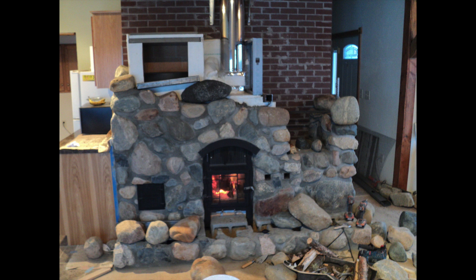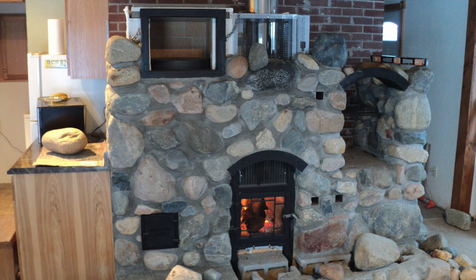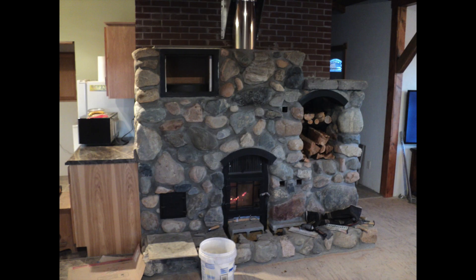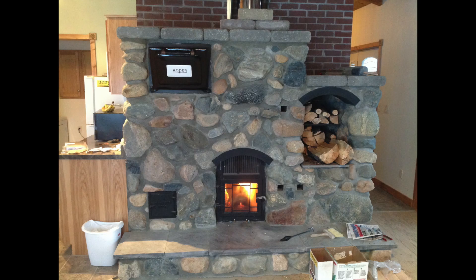The frame for the firebox door is made of steel square tubing. The bottom of the tubing is open to the passage in the hearth where the fresh air enters. I continued with the stones, added the oven door frame, and some steel framing adjacent to the oven to support more stones. I finished up the stonework, then formed and poured a concrete cap over the wood storage area. I did place some rebar across the span in the wood storage area — this served as a shelf and to help tie in the end stone wall.